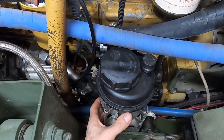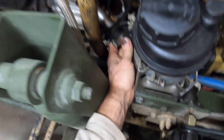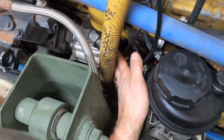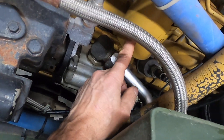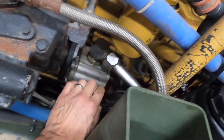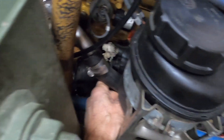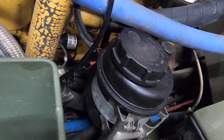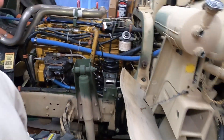In the meantime, I had taken my power steering reservoir off to put some new hose clamps on it. The hoses seemed twisted and this pipe was sticking out awkwardly, so I wanted to loosen and turn it. I couldn't get a wrench on it because the fuel filter was in the way, so I had to take the fuel filter back off, loosen the fitting, and turn the pipe so it wasn't binding and the hoses weren't hitting together. Hopefully we don't have any more power steering leaks.